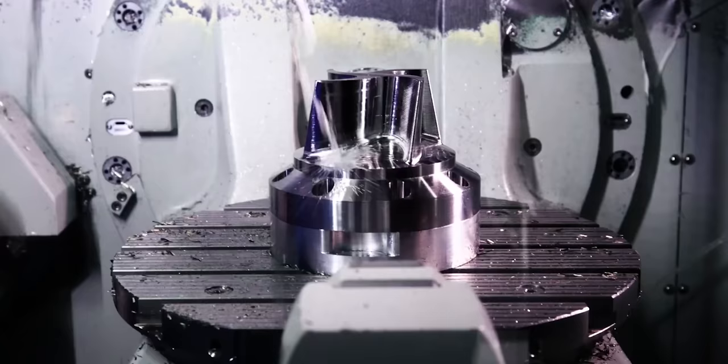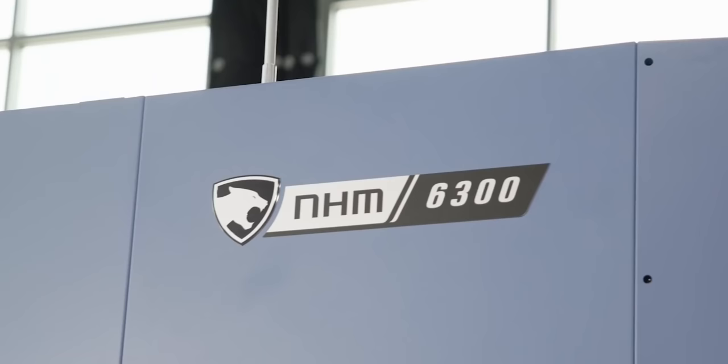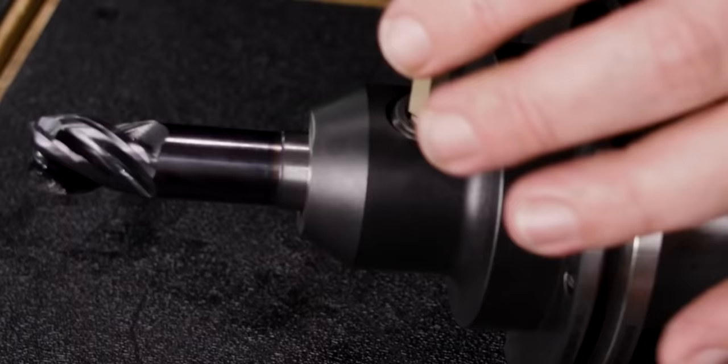Up the roughing operations on our 15.5 part. Take a close look at this tool. Every single cutting edge is chipped for at least half of the length of the flute. It's even missing a corner. So what happens when you take a damaged end mill, throw it in a tool holder, and then go full slotting an inch deep through 1018 steel? Let's find out. It's go time.